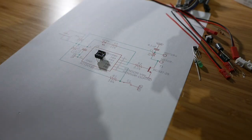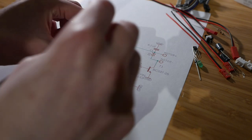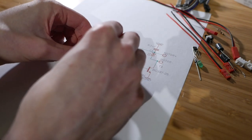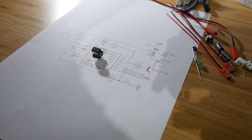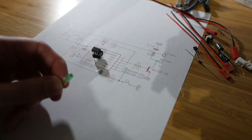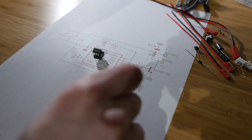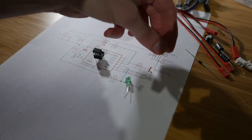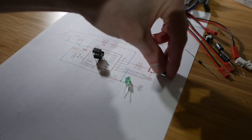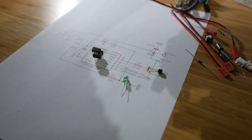Since I'm testing this as we go, I decided to get one of these connector adapter things where you can put your tiny microcontroller into. Some other things we'll need: a debug LED — I'm going to go with green, though you can obviously go with any color. And then we need a transistor, an NPN transistor. It should be able to handle the current that the motor draws.